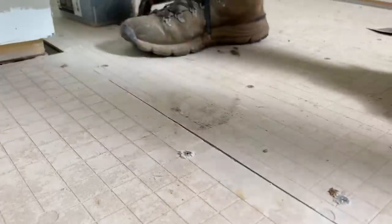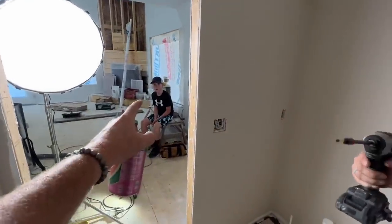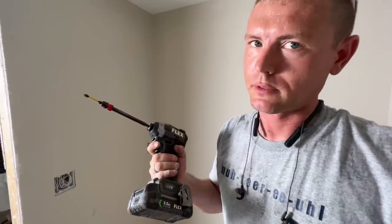I'm not a huge fan of Phillips head anything. This bit put six screws in and now it's toast — it's twisted, you can't even use it. I've already used two bits and I've only put down three pieces of board — that's like 165 screws for three sheets. I've got dozens of the short ones from a set, so I'll just burn through them. But I have something important to say: as much as I hate to switch to the impact driver for these Phillips head screws, it is way better. It just works so good — you can't beat it.